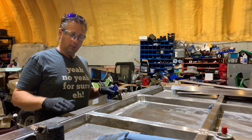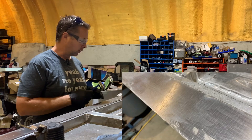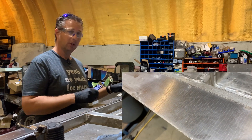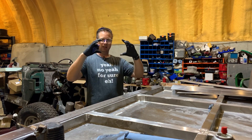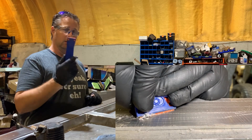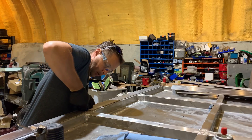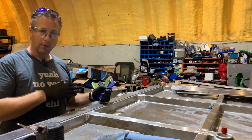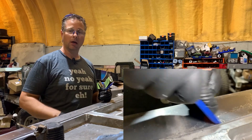I do have one piece that's really fighting me. This must have been the very top piece on my pile outside because the plastic on it has completely degraded — it's got a checker pattern all the way down it and has zero strength left. Whereas most other pieces you could find a peeling edge and pull off chunks, this one is 100% scraper work. But this little plastic scraper is 100% doing the job. You've got to lean into it pretty hard, and it doesn't come off in one sheet, but it definitely works. I come along behind with the brake cleaner, wipe it down with a paper towel, and it comes out completely clean.